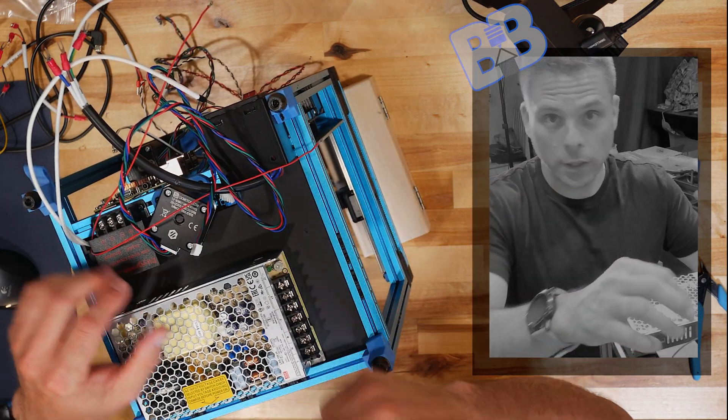Now we have our part cooling fan. The part cooling fan connector goes up here, which is the connection point nearest to where the hot end plugs in. Quick rundown of the board: steppers are all over here requiring 4-pin connectors. Miscellaneous connections like end stops and thermistors are here. There are additional connectors for probes, a display header if you want one, SD card slot, USB, jumpers, your 24-volt input, bed and hot end power with a 20-amp fuse.